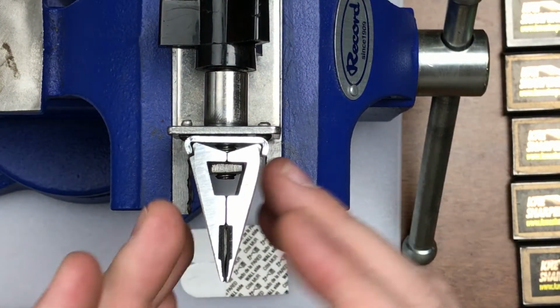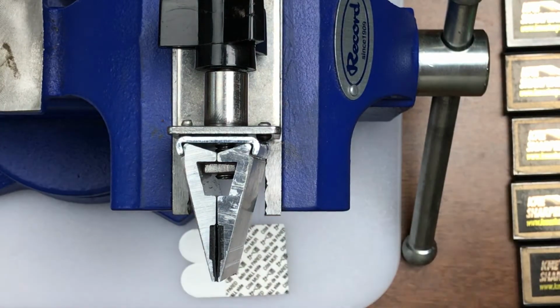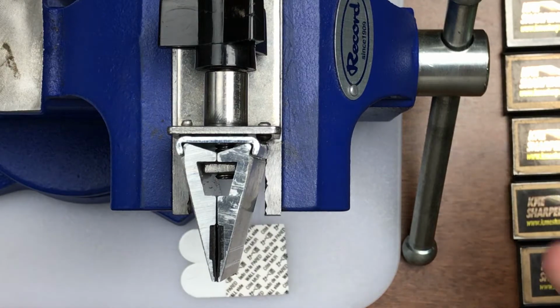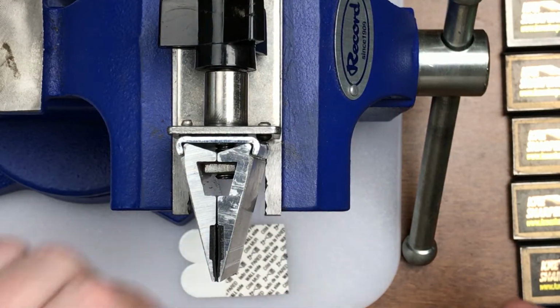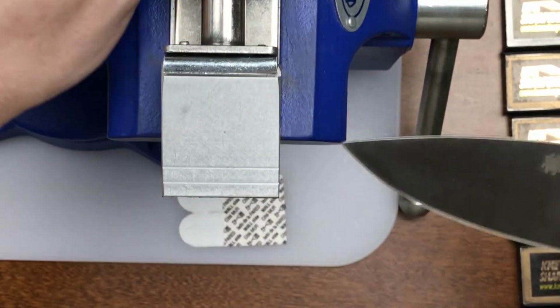if you're using the KME system, you can see here that we have a little bit of edge, and then we have some more rubber, and it kind of falls down in those areas. And what that allows you to do is grab a hold of some of the thinner blade stock full flat ground knives. I'm not sure if this Polestar is going to work out that way, but some of them do, some of them don't. The thicker the blade stock or the shorter the blade, the more severe the angle of your full flat grind, and the more severe angle, of course, you have problems. And if you do have problems, I'll show you what to do. So we'll try this Polestar and see what happens.